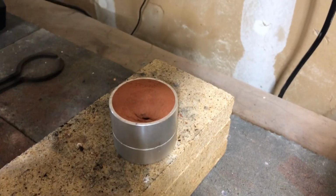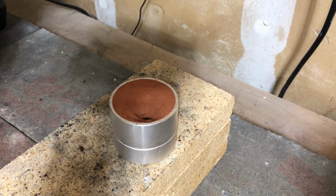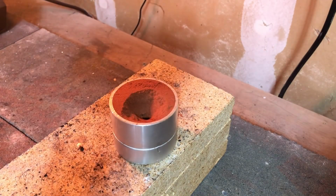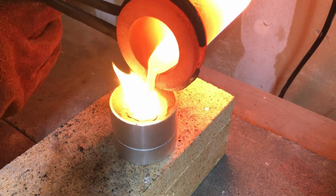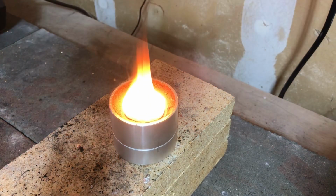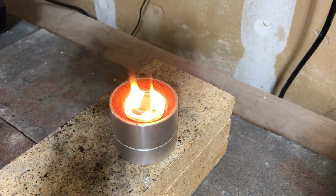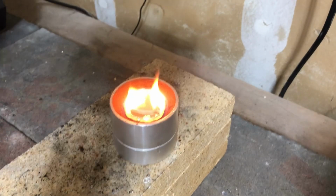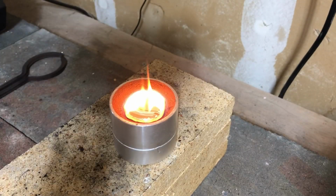You want to make sure you pour it pretty fast. So let me grab it and we will fill it up. All right. Here it comes. Now, like I said, just pour it pretty fast. So there we go. And it's okay to sort of bubble it out. You don't want to have the silver go all the way to the edge of your mold there, because if you do, you can actually ruin the mold.